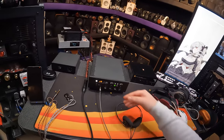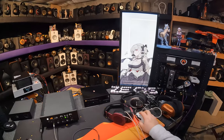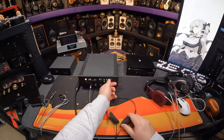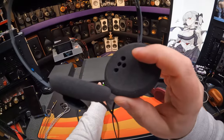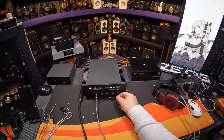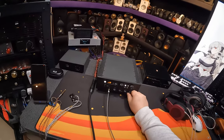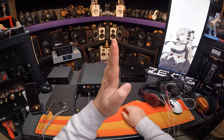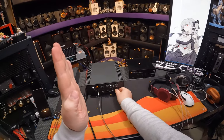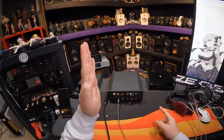So if you turn this all the way to the left, you now have mixed left and right channel. And the best way I could test this out, as far as I could tell, was I put on the headphone demo left-right noise. You know what I'm talking about. Hold on. Repeat track. Right? Here, left. Left. So if I put this on and take it out of direct mode, it's now playing out of both channels. If I turn it up one notch, it's playing mostly out of the left, but not only the left. Then one more notch up, it starts moving out. So I'm hearing it out of both ears. It's basically a cross feed at this point.